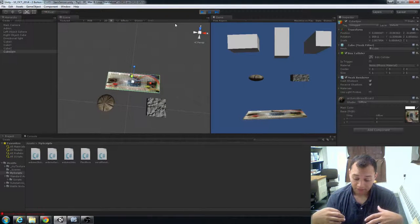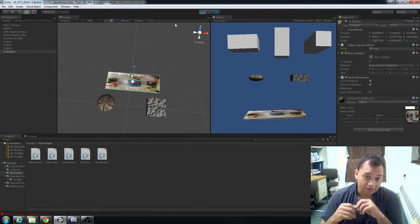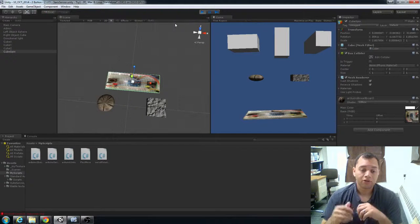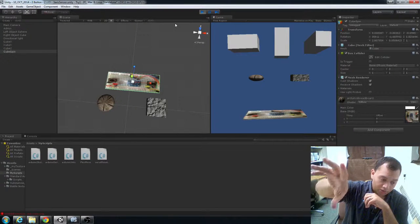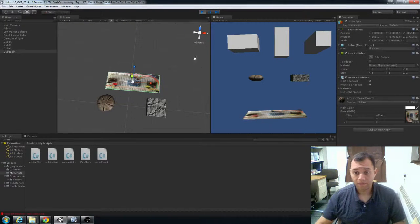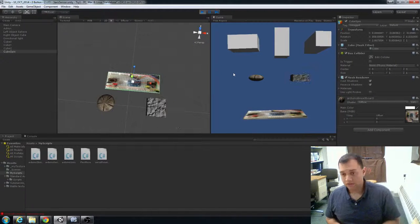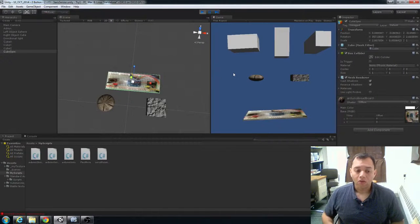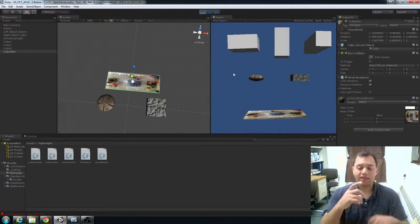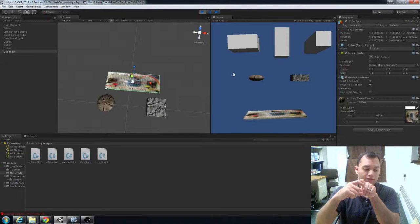The accelerometer, very cool. It does have its uses, just not the one I want exactly, except in a limited capacity. I might end up using it, but I am going to take a stab at using a gyro independently, and then using a gyro along with the accelerometer. And then as far as finger position, whether it's open or closed, like I said earlier, I'm going to use the buttons, which will close and open on the shapes in there, or I will go ahead and use these potentiometers to measure the angle of my knuckles right here and here.